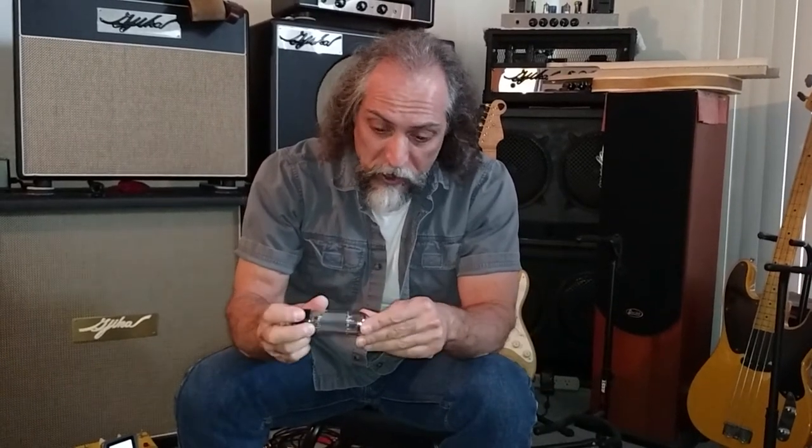So that couldn't happen, because what we had was single-ended amps, all right? And you still couldn't get much power out of them anyway. But that was the biggest stopping point, okay? And then the tubes people like for guitar are not those tubes that have that thing on the top. Those tubes sound like crap if you try to use them in a guitar circuit. So now you're back to this, and you're back to this blowing up, okay? So this is a definite stopping point for most people from building high-power single-ended amps.